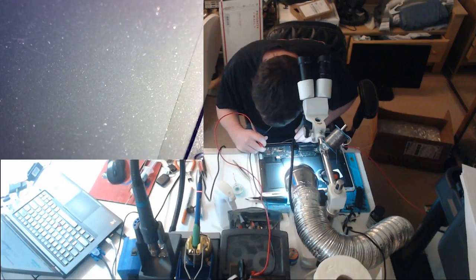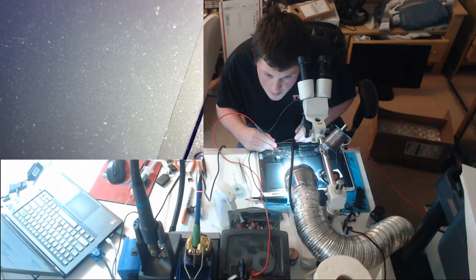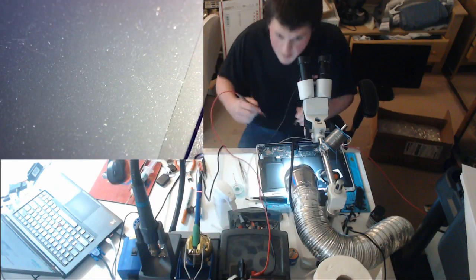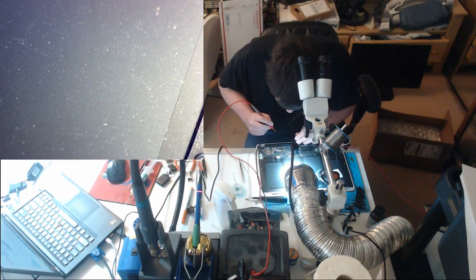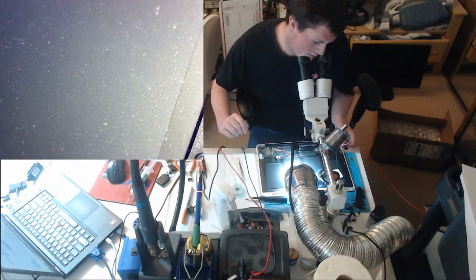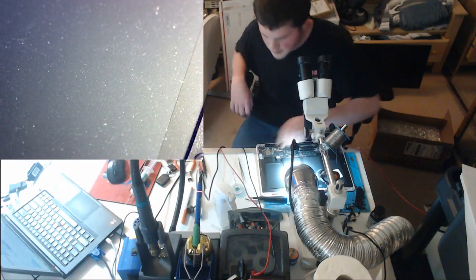Where's our little backlight fuse? I want to measure backlight voltage. Oh, that's on the other side of the board. And we get 8.59 volts on PP bus G3 hot. Now, given this is an error, we have PP bus G3 hot and a green light in the charger.